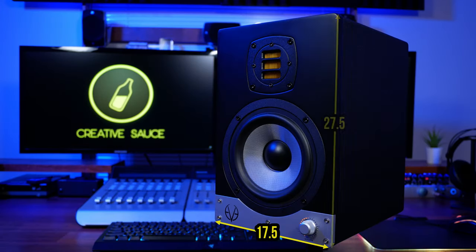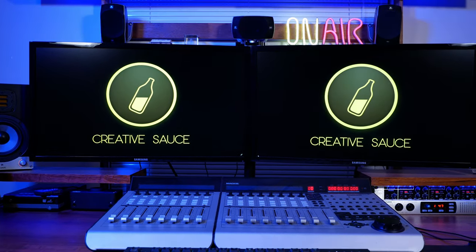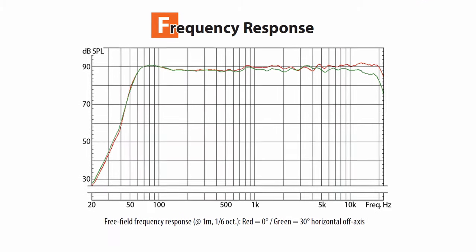So the most obvious question to tackle with these monitors is their size. They measure 17.5 by 27.5 by 23.3 centimeters, so in a small room these could be ideal. They'll fit on most desks, but if you can't fit them on your desk you can also pop them onto microphone stands. As we all know, with smaller monitors you will have less low frequency response, and that's certainly reflected in the charts with quite a steep drop off at 53 hertz or so. But this could actually be an advantage in a small room where low frequencies can be very difficult to keep under control. And in any case we don't listen with frequency charts. My experience with these monitors is that I've been constantly surprised at how much low frequency response I do actually get — it's also nice and tight and punchy.